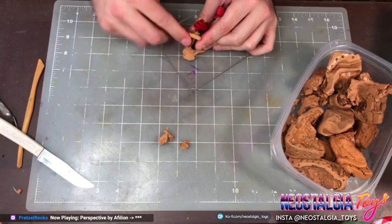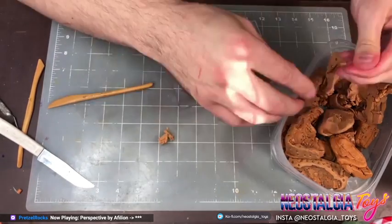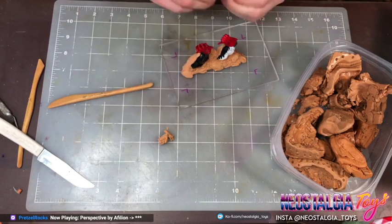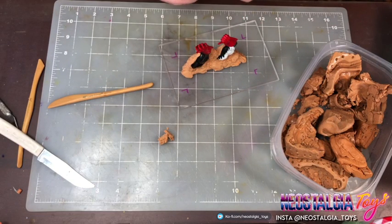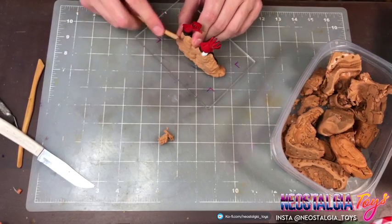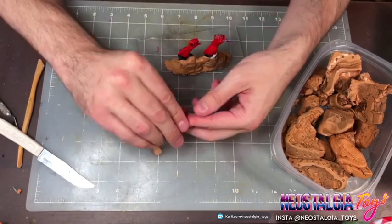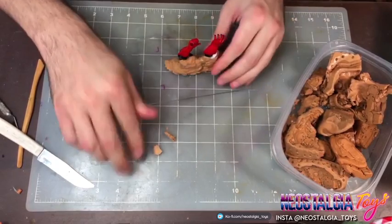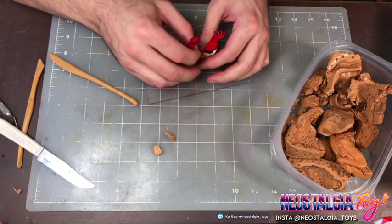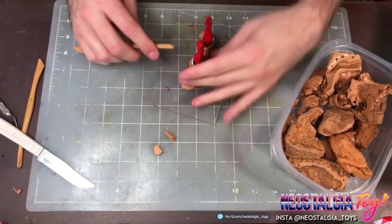Also need to come back through here and define the parting line, but I won't do that until I've built up this back, because I'm going to be putting pressure on it to carve that out, so it needs to not want to fall over when I am pushing back on the clay. This clay back wall built so that I can start putting the box together to then build up the sides and create the top shelf, and then I'll define the part line, put in the final venting.